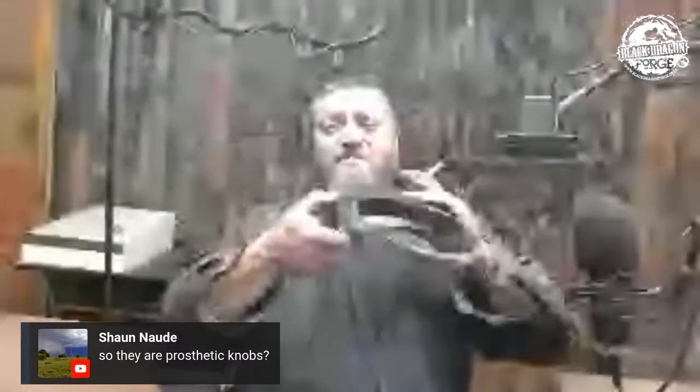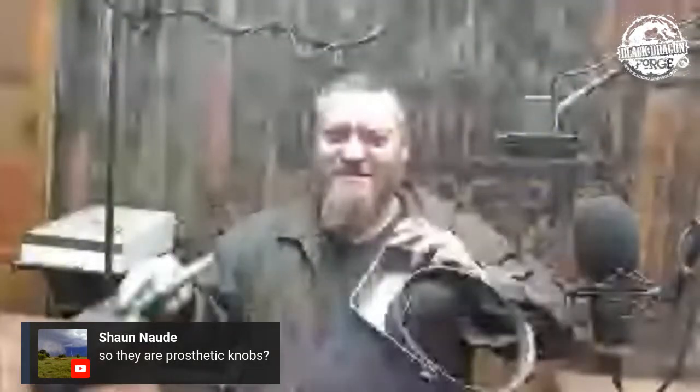Look at my face — I've got this slight freaking blue tinge, and this is the reason you wear Optivisors. Everything you look at gets a blue tint and when you take them off you've got no more blue tint. Don't rub the lens — that's an abrasive, so that's why you've got a desk brush. Ask me how many lenses I've replaced on this Optivisor. This is a number five lens, which is a two and a half times magnification. Everything I do — whether I hand sand or take a splinter out — I do under that, because I'm as blind as a bat.